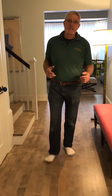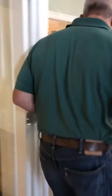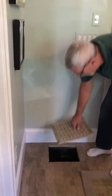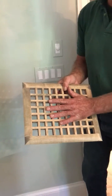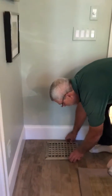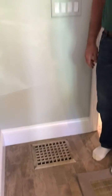We also had some custom wood floor grates made up for this job. I finished them in my shop and I'll show you one right over here. We've got a return grill, and the return grill here is a drop-on model. These are egg crate style, and the reason we have these is so we get good airflow to the furnace and the air conditioning. They drop right on and fit right in nice and tight — it's a great accent to the floor.